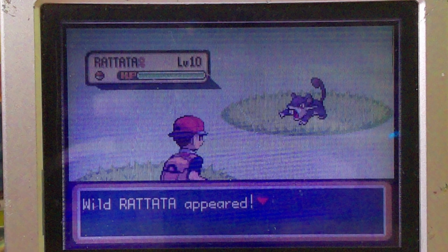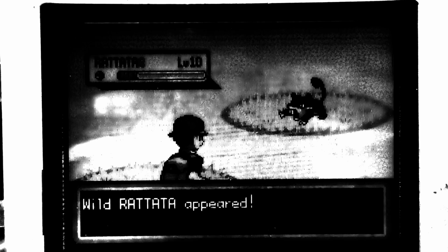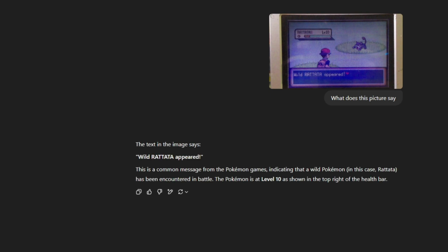One eternity later. This one problem has eaten away hours of my life trying to get right. I tried every trick in the book to get it to be readable. Grayscale the image, upscale it, apply a Gaussian blur, denoise the image, apply binary and adaptive thresholding, all of the above at once. None of it was enough to get these lightweight models working on the Raspberry Pi. If I take a picture and feed it into a larger, more capable model on my PC, it has absolutely no issue whatsoever, but that can't run on a Pi, so no luck there. I was smashing my head against my desk, trying to think of ways to get this thing over the line, because failing out was not an option.